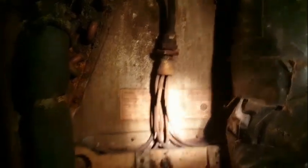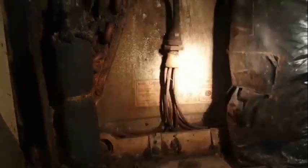She's gonna be nice. We have our evaporator coil here. Orifice size 77, 3.5 tons. Serial number C3099. I guess it's a 1999 probably. Not quite sure. Maybe we'll see some more hints before we're done. Pretty dirty, so it definitely needs to be taken out and cleaned because it stinks.